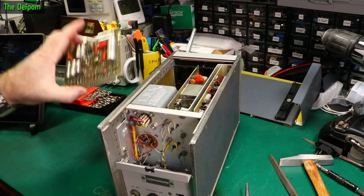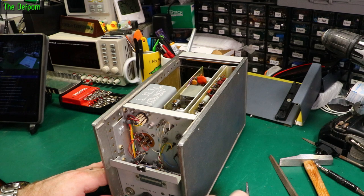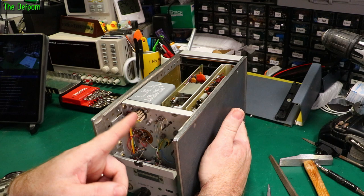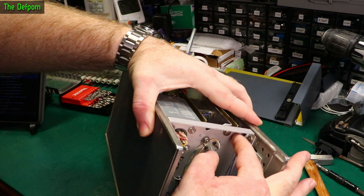I just removed the card — just lifted it out — which gives access to the back of this. I'm just looking at this mains wiring and I'm just not sure I'm happy with it because it's awfully thin wires. I mean it's probably fine back in the day, but this is 50 or almost 60 years old now. The quality of the wiring seems fine — it's not like it's cracking or anything. There's a transformer over here — weird transformer wiring, strange setup, never seen one like this before. We've got some wires going through a little grommet here, but it's a metal grommet.